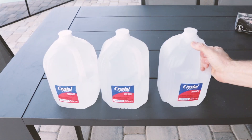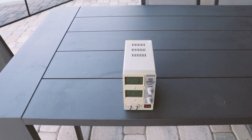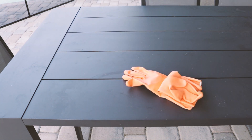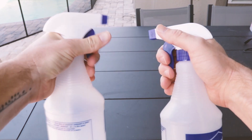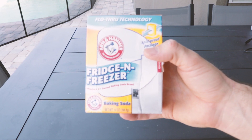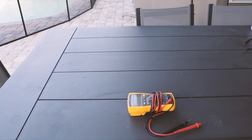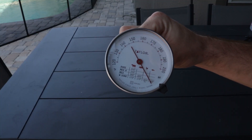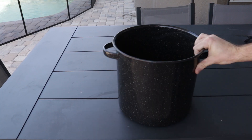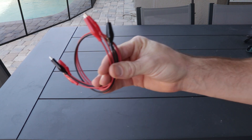Distilled water, battery acid, power supply, rubber gloves for handling acid, bucket for anodizing bath, sprayers of distilled water, baking soda to neutralize acid, voltmeter, Scotch-Brite pad, orange clothing dye, meat thermometer, roll of lead, bucket for heating up dye, degreaser, titanium wire, alligator clips, banana, rubber gloves.